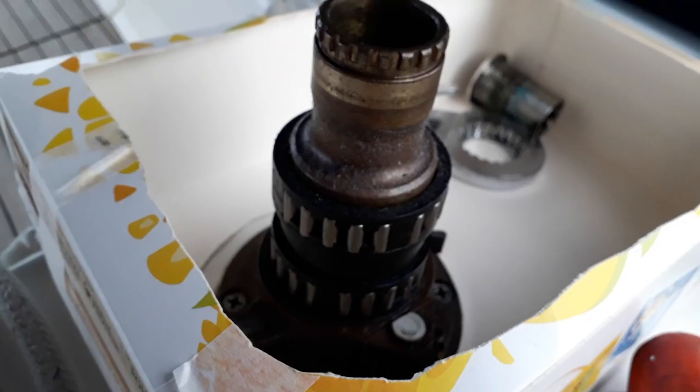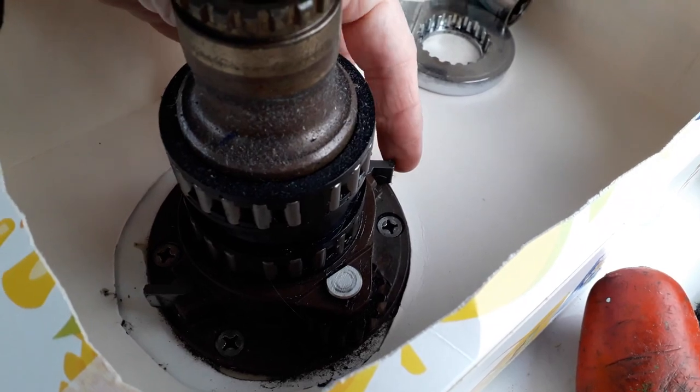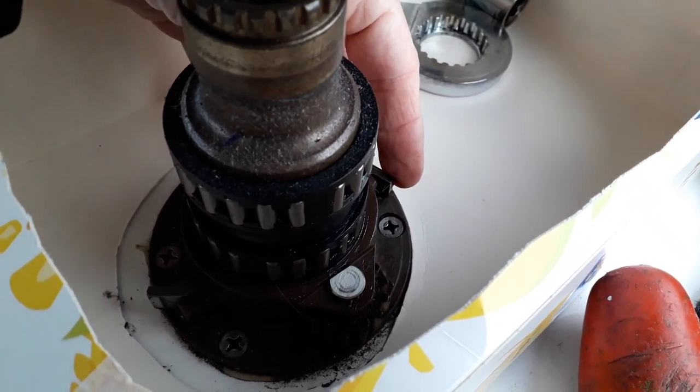Well, today's job is to do the smaller winches. These are very similar to the larger winches that I've done. The difference is that there's no secondary gearing on this — these winches are single direction, single speed. They don't have the gearing that's inside the main hub. These ones are a lot simpler. On the outer perimeter of the winch itself there are two pawls that engage the actual bell housing. I don't need to lift the central shaft out and do all the rest of it — I can just give everything a good clean and wipe down, put some oil in, and I should be good to go.